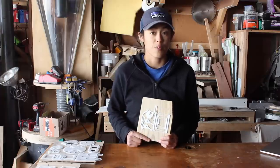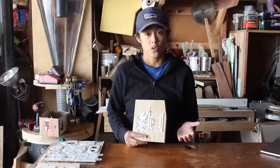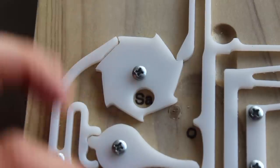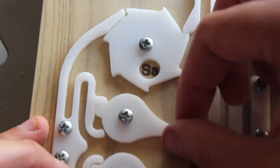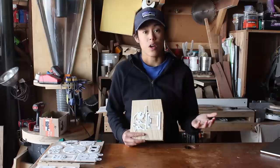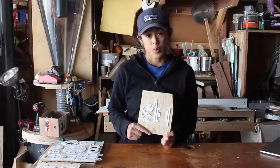Although these parts show that this mechanism does work, they're definitely far from perfect. In CAD I designed these parts to be line to line, so of course the real parts are slightly deformed and the assembly has some gaps. The deformation was probably caused by prying the parts off the machine, or perhaps there were internal stresses inside the plastic that were released when I cut the parts from the sheet. Either way, if I wanted a better shot at making an assembly with zero gaps, I would design these parts to be an interference fit.